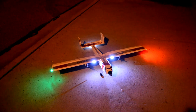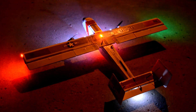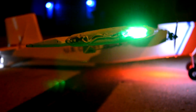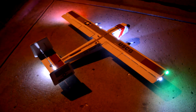I have four different sets of lights controlled by an Arduino microcontroller. The lights are connected on the ground side to a Fairchild PN2222A NPN transistor, which is turned on and off by the Arduino Nano. The first set are navigation lights — a solid red on the left, solid green on the right, and solid white on the tail. I also have strobe lights: three white lights that flash very fast, one on each wingtip and one on the tail. There are also two anti-collision lights — red strobes that flash slowly.